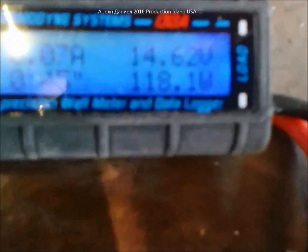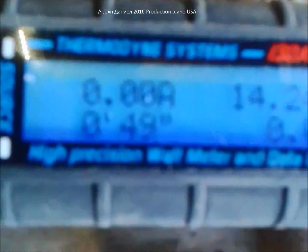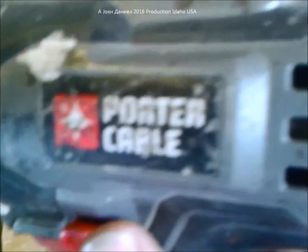The fact of the matter is that a new battery might make a difference. Now 650 RPMs and four-foot blades is roughly about an 18 mile an hour wind speed. That's telling me this thing is coming out pretty true. I got a new battery here — listen, it's a lot louder. We chuck it up and you can see it peaked out: 126 watts peak wattage right there.